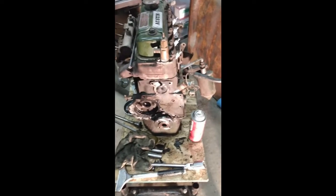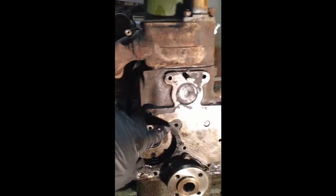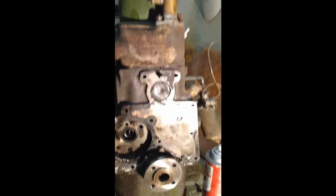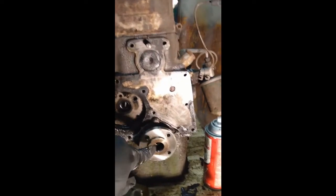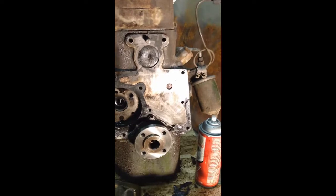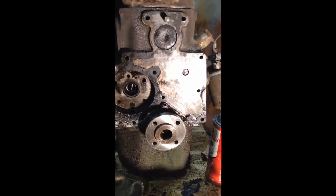While I'm waiting for transmission parts, I'm going to clean off the back here to get all the old gasket off. I've already got some of it off and will get it all cleaned up so I can mount it up on the engine stand. I had to make one repair — I left a whole bunch of threads behind when taking one of the flywheel bolts out. So there's a new flywheel bolt coming and that cleans up quite nicely.